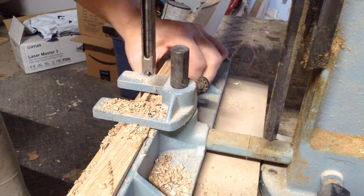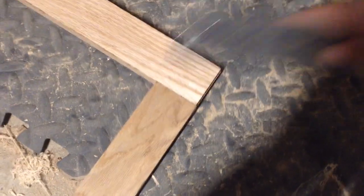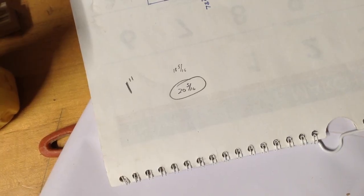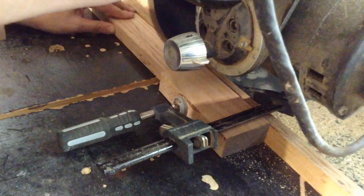Making mortises with a mortising machine is pretty straightforward. I line these up and get my inside measurement — I like to get these towards the top because it's going to be the most accurate measurement; towards the center, where the wood's bowing, you could be a little bit off. So I make sure the door is square, dry fit, got my measurement, and then I added an inch on both sides because I'm doing about an inch deep mortise. That pencil mark designates the inch tenon I'm making, and that inner dimension is the 28 inches and some change for that inner frame. Back at the radial arm saw making tenons — it's essentially a double-sided lap on the radial arm saw. I set everything up, do a couple test cuts, get it dialed in, and then I can make my three tenons, one for each of the three doors.